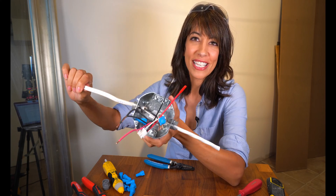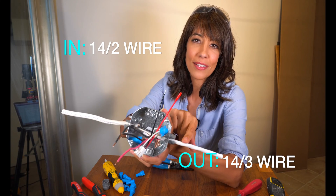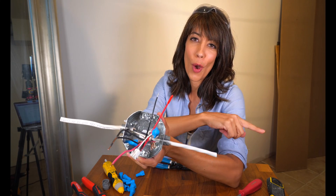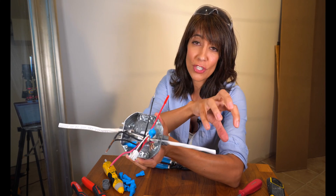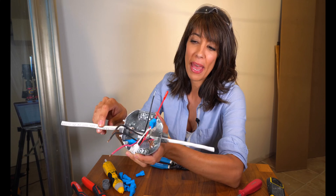You can see the wire coming from the panel is thinner — it is our 14-2. We have our 14-3, and that's going to connect this unit, this detector, with all the other ones in our home. Every wire after this junction box is going to be a 14-3. So we have this from our panel.